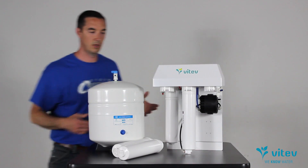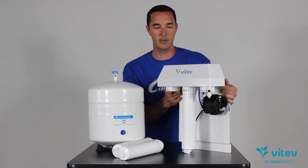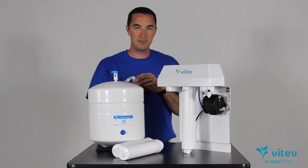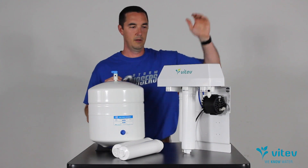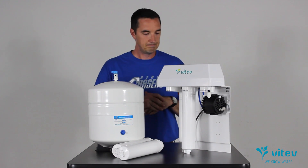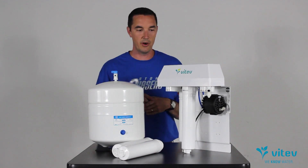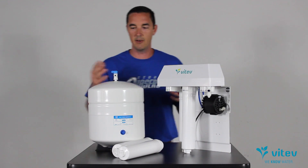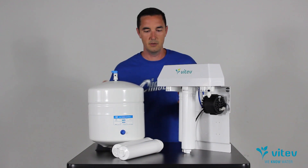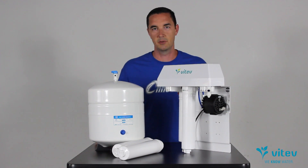All of that is going to allow you to figure out which cartridge needs to be replaced, and it's going to give you a lot more information to help the technical support person if you need to call them. The biggest recommendation: work back to front. You'll have a very good understanding of what's going on at that point. Also make sure your valves are turned on all the way — that sort of common-sense stuff — but obviously check that too. If it's a filter issue, that's going to be the best way to diagnose it.